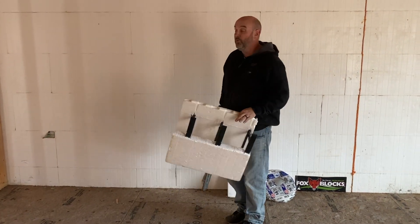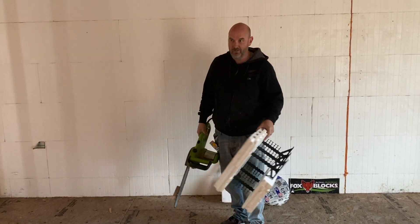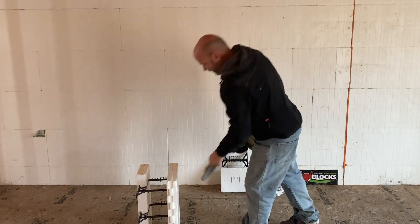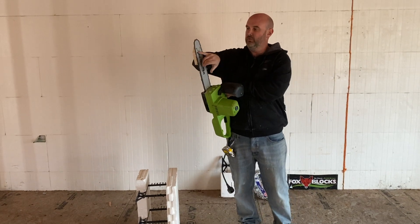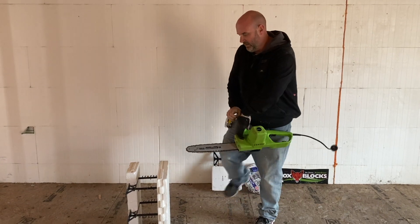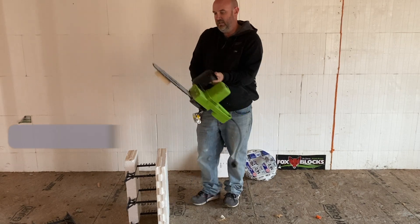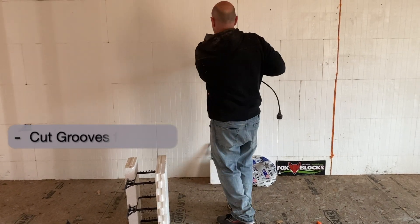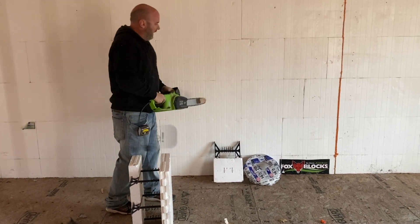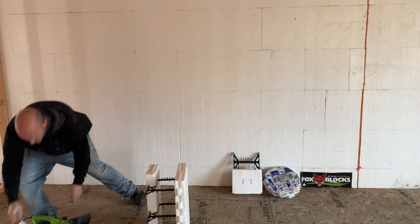The number one question we get on these is how you wire them, because people that have ever seen a house wired before wonder how you're going to put wire through a solid wall. So what we do is we take this chainsaw. Almost all chainsaws have a little hole in the bar right here, and we just screw a little wooden block on and make sure that it bottoms out just before it hits the concrete. That enables us to just cut grooves in the wall where we want the wire to run, and then we will cut out where the boxes go.